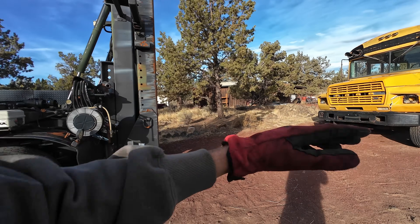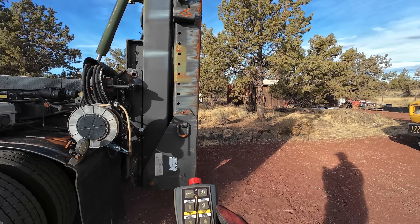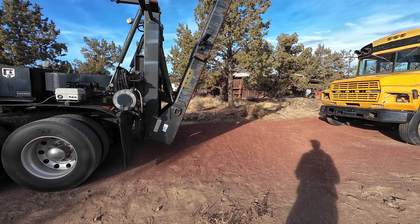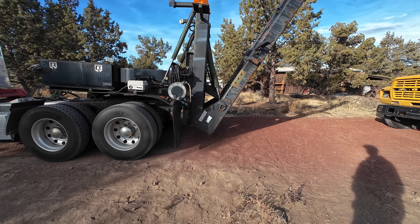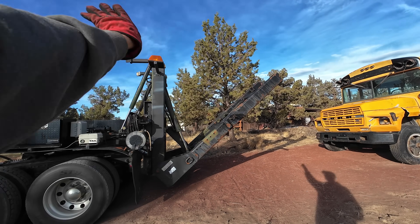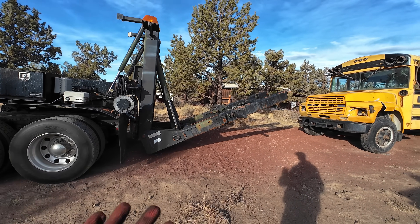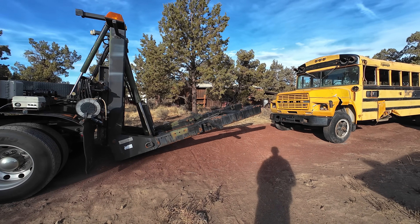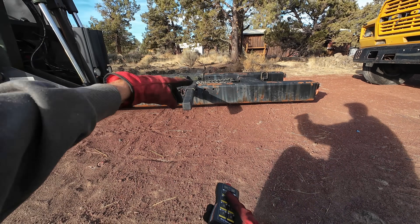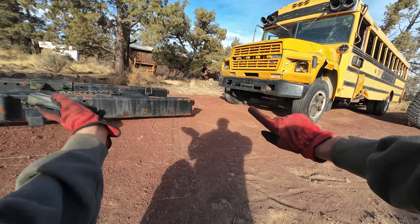Now we want to fold our legs down. We go to our boom cylinders - the mast is the mast, the legs are the boom. We boom out, extending the boom cylinders, and the legs fold down and you'll start to see this thing look like a towing unit instead of a crazy fifth wheel mounted rocket launcher. These legs come down under the bus - we're using the school bus because even though it's so lightweight, it's so open you can see. These here are your tire stops, locked in place with set screws and pins. You can slide these stops forward and backwards depending on the vehicle you're towing. You ideally want the front bumper as close to the stops as possible.